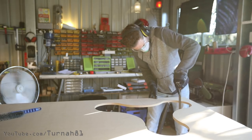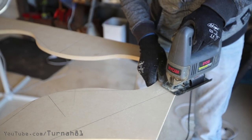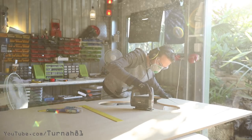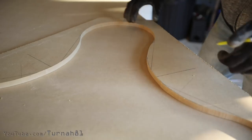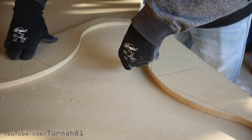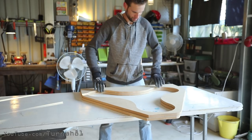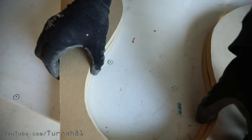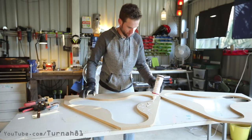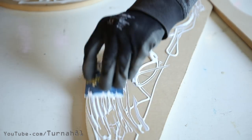Now it's time to smooth out some of those edges. In this instance I'm using a metal file because I don't own a wood file — I find them to be a bit arrogant. Now we do the outer cut around our mold, leaving a bit of meat around the edges to allow for a bit of strength when we pour our concrete. There's nothing like the smell of carcinogenic particle board dust in the morning. I want the concrete to be as thick, if not a little bit thicker than the bearing, so I need to use two boards back to back. I'm using the first cutout as a template for the next one. And there is my first mistake — although I like to think I'm a jigsaw accuracy ninja, there's no way these two are going to line up, and they haven't. All of these dodgy lumps and bumps are going to snag on the concrete when I try and push it out of the mold. In hindsight I should have cut out the outer shape of the first mold, then laid it on top and cut through both layers at the same time.